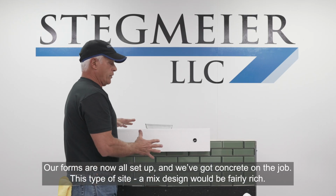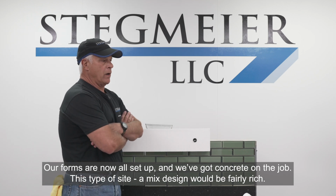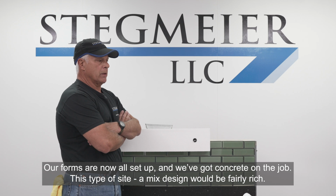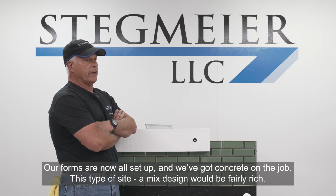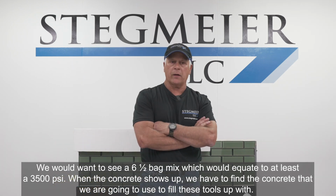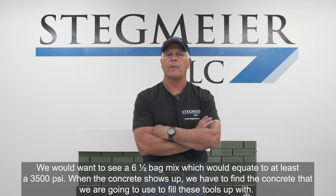We've got our forms all set up, and we've got concrete on the job. This type of a site, a mix design, would be fairly rich. We'd want to see about a 6.5 bag mix, which would equate to at least a 3,500 psi.